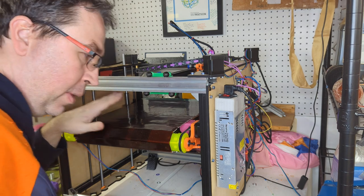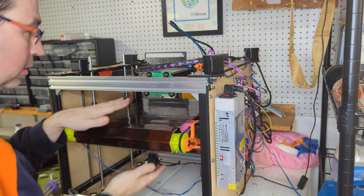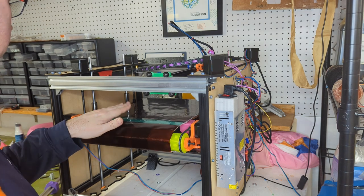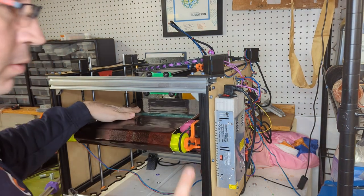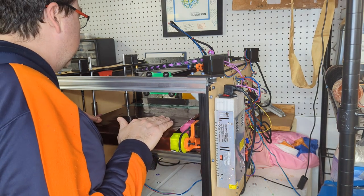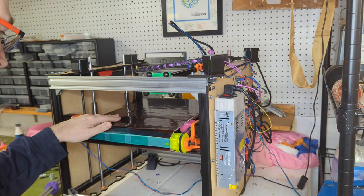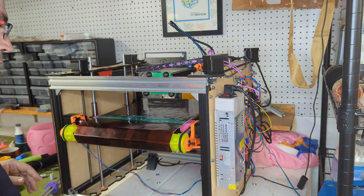With a little extra tension on the belt, we do have still quite a bit of angle. It's not exactly tight, barely compressing the springs. There's no gap. Yes, that is going to cause problems. I didn't make a gap on the joint, so that's why it gets stuck on the joint. We learned about gaps. They are important. We need to redo the joint. We'll be in business.